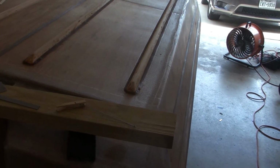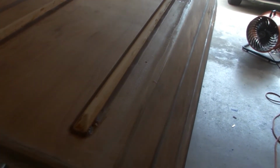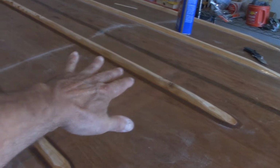And I'm back. And just like that, I got the first two strakes faired out with the wood flour epoxy, as you can see there. Might have to come back and do a little bit of light sanding on that. Shouldn't take a whole lot. But once I get that side done, and once I get the fiberglass tape laid across these, I'm going to go with two layers of that fiberglass tape. Once that's done, and once I get this corner taped off again, then we'll be ready for that last layer of fiberglass cloth that's going to lay over the bottom and down the side.